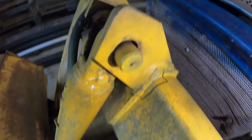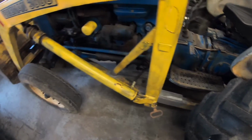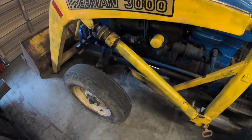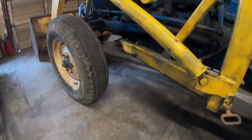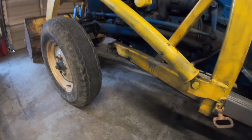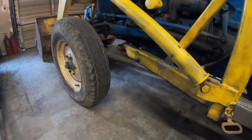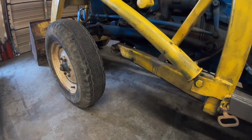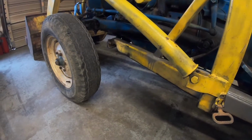And we'll check everything else too, but basically what happens are hairline cracks that get magnified when you fix such a big issue that it starts to put pressure on other areas, and then those hairline cracks turn into big cracks. So we'll get in there, we'll grind them out. That one, I'm gonna have to get in there with a die grinder probably because I can't get a regular grinder in there. The other one I should be able to, but we'll show you all that, and we'll go ahead and get started and get these fixed up, welded up, and get them on his way.